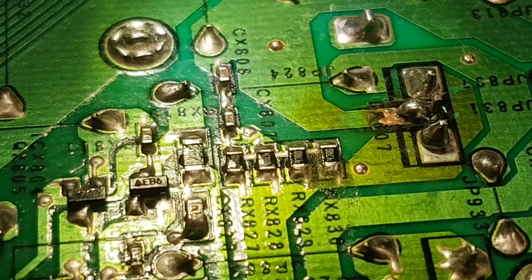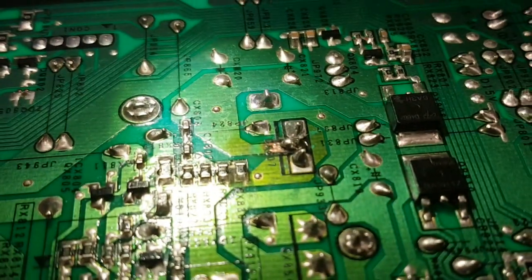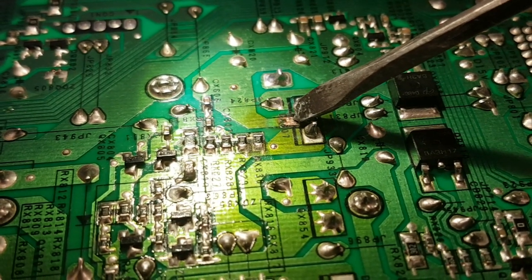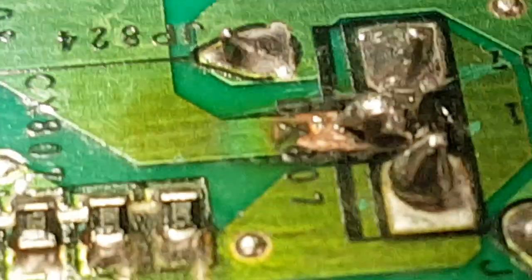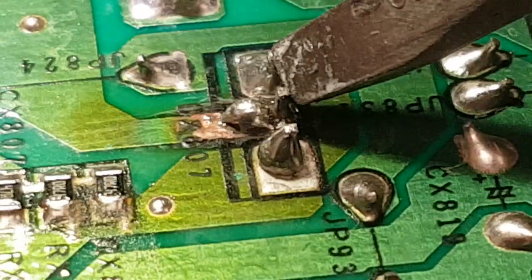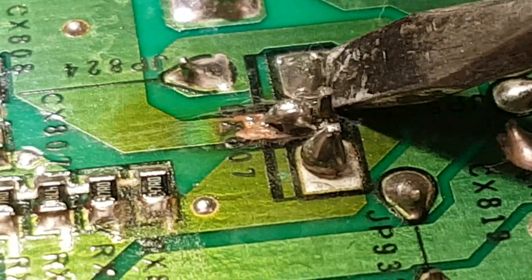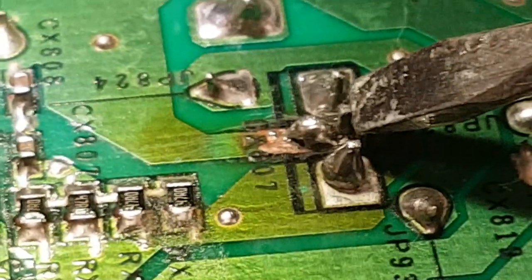It starts creating a circle around the leg — there are so many videos showing this on all kinds of boards, devices, and appliances. It's a really common issue. But this fix was not done right. What was done here is somebody maybe just cleaned the track around the board — it usually gets burned from arcing. The bigger problem is that they merely soldered it without increasing the contact area, and they probably didn't clean the leg. There is very little copper left on this side, and it's tiny to begin with — that's a design problem with Samsung's board design.